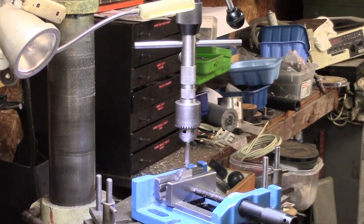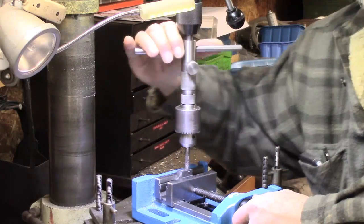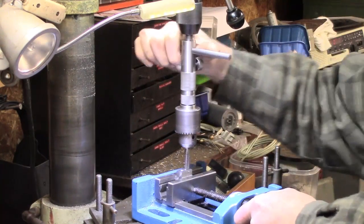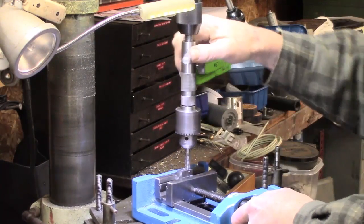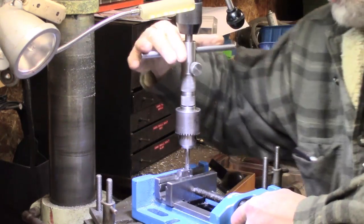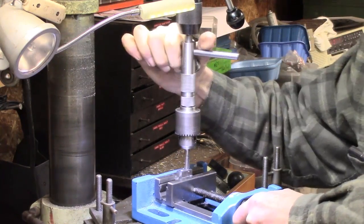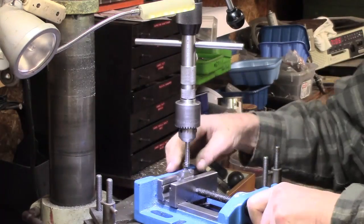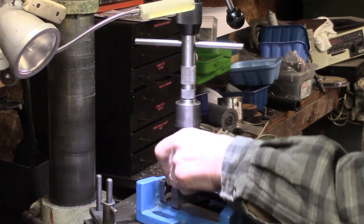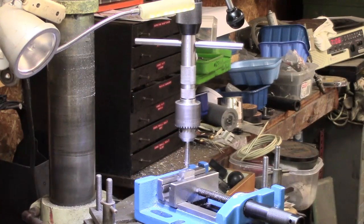Just a slightly wider view of this tap starter. I was using the chuck before. I didn't know whether the chuck would hold the tap for long enough, but in fact I've got a fairly good grip on it, so I should be able to probably get 2.5, 3 turns. In essence, it's a case of going on till the tap slips in the chuck. So that's got about 4, which is enough. As I say, it's just a case of when I finish them by hand later of having everything nice and square. So we'll do that one and the other threads.